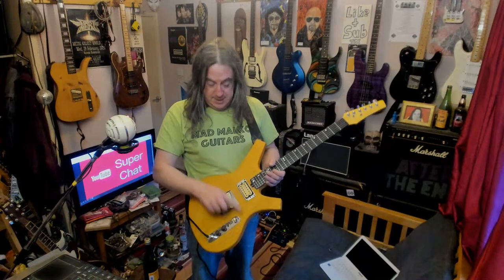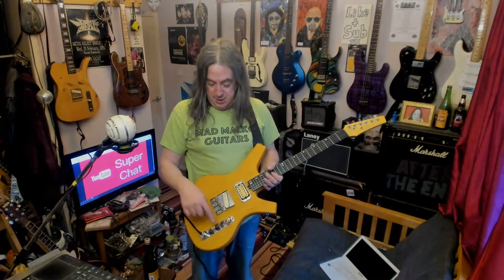So I did that, which means I did it after the volume control. So when you've got another lead plugged in, the P bass pickup and the tone control still come out the main jack socket going to your amp. But the second socket has now got its own volume control and it's another output which you can stick into another amp. And I really like that.